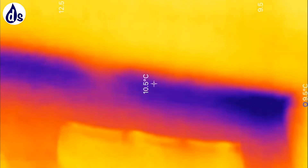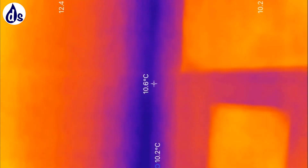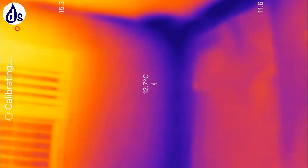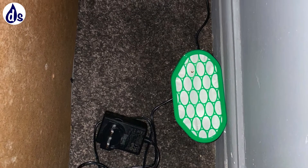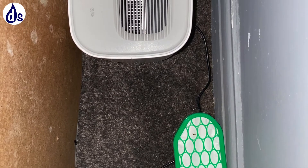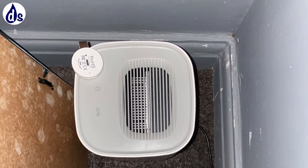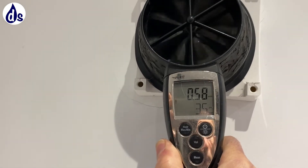In the rear bedroom we're seeing a lot of cold, and part of the problem is the extra heat loss from the external surface area but also the lack of airflow of warm air behind the bed. Even though you've got small dehumidifiers, they make very little difference. You can see the mold on the back of the picture — mold grows when relative humidity goes over 85% for long periods of time. It's the humidity from the bathroom — which I've now solved — but also the heat loss, so the bathroom extractor fan is hardly moving at all.